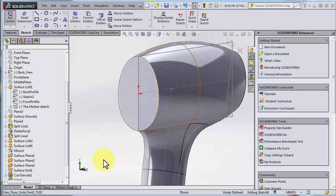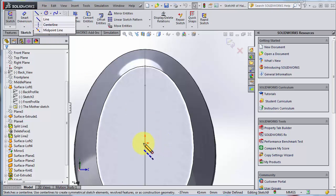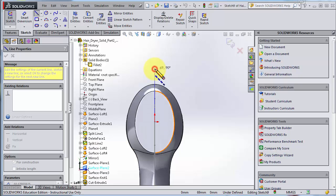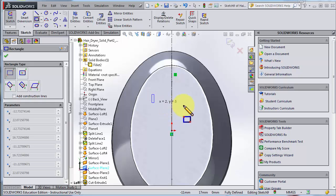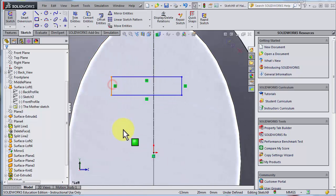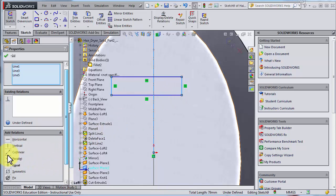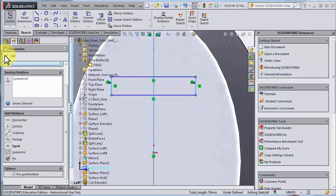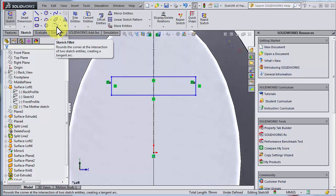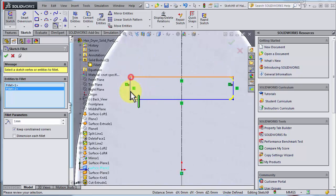Look at the corner — let's go flat because we're in a sketch. I'll go for a center line; it's not always necessary to have one, but I find it quite nice. I throw out a rectangle and by purpose make it a little bit non-symmetrical, then force it to be symmetrical: shift-click the center line and two other entities to make it symmetric. We could then start to add fillets — you don't need fillets in a sketch, you can add them later, but in this case I'll add them in the sketch.